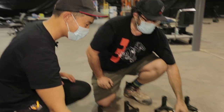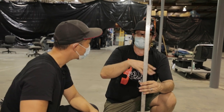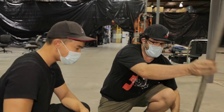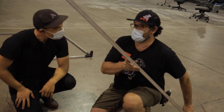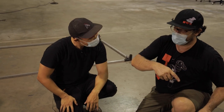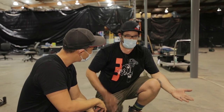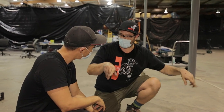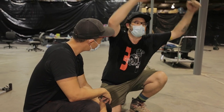So there's going to be a four-foot piece for the short ends of your rectangle, and then we have an eight-footer that'll be the length of your box. So it'll be four by eight by two feet deep. What you're going to want to do is build your bottom and your top — your full four-by-eight frames — and then you put in your two-foot uprights and put the lid on.